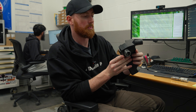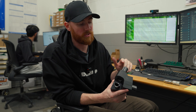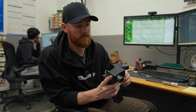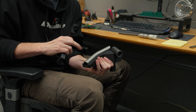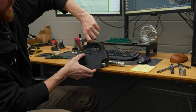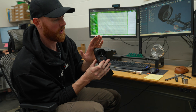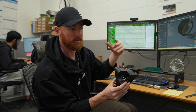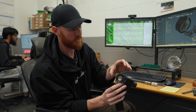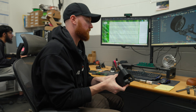It's really fast and repeatable — this is just PLA, 25% infill with four wall layers, and it was absolutely solid. I blasted right through it at full speed with a little lubricant and it worked really well. It's a sandwich block so I can separate the two halves, place the tube in there, clamp it on the jig table, and have access to both cut points. This is something you can do at home, completely done through Fusion — if you have a 3D printer you can turn printed accuracy and alignment into something potentially quite profitable if you make repeatable jigs.